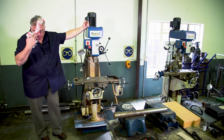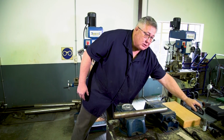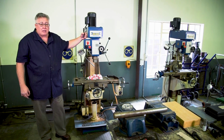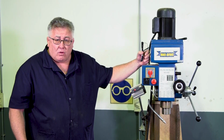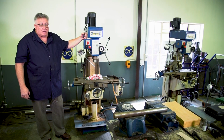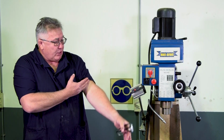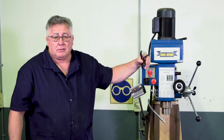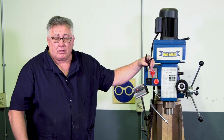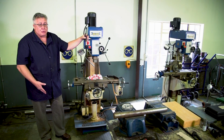The next safety is your person. Your personal safety is important, and that's where your PPE comes in, personal protective equipment and clothing. And that normally revolves around a full overall, in my case, a dust coat. Very important when you work on machines is short sleeves. So if your college issue you with a long sleeve overall, the sleeves must be cut, or at least rolled up above the elbow. The next safety is safety shoes,